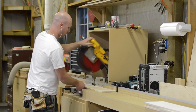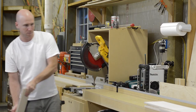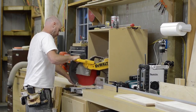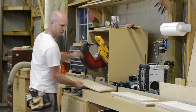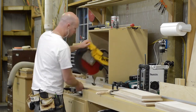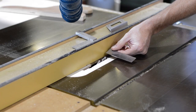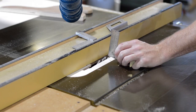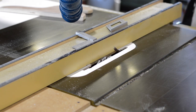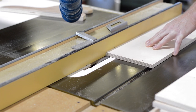Note the twin flip stop setup — this really helps maximize yield out of each of the strips that I cut. For these drawer boxes, the sides are cut to 22 inches and the fronts and backs are cut to 26 and a half. The last operation before assembling the drawer boxes is to run a one-quarter inch groove about a half inch up from the bottom.